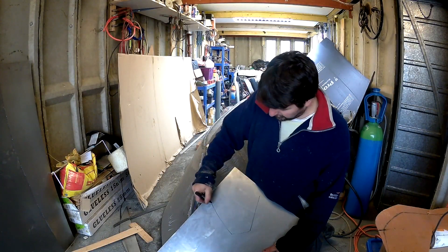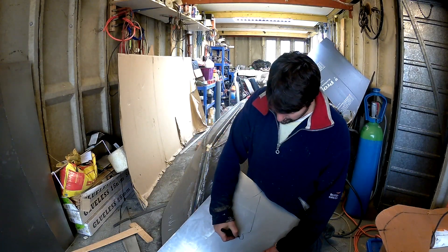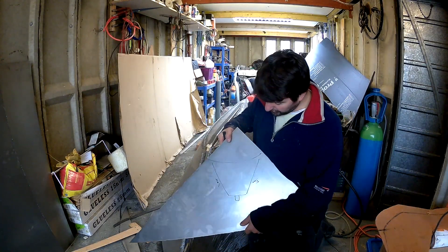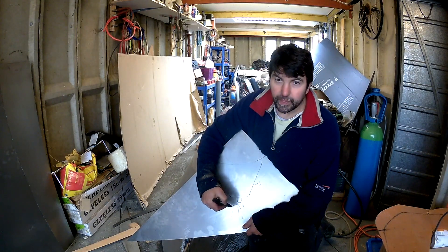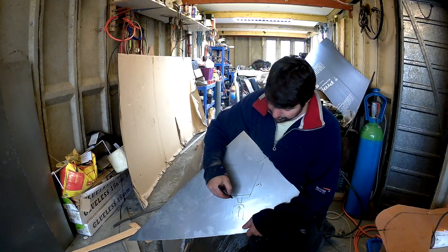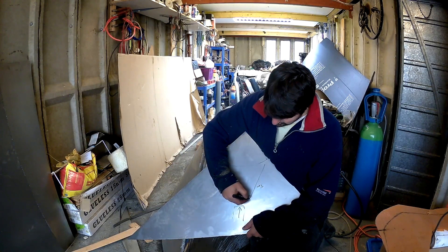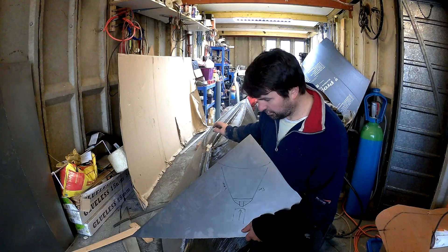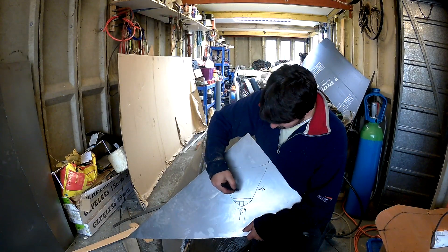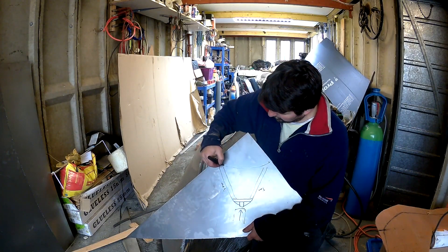My keel is going to look something like this with the boat up here. I've stuck this piece of skeg material on a fat piece of 3mm steel — so this is all 3mm around here. I'll put the blocks here and the boat will sit on here, but obviously this isn't strong enough on its own. Internally I'm going to put some cross braces at logical points like the bulkheads to spread the weight through the 3mm material. I'm also going to put pieces on the side to form a nice triangular reinforced section, which will make the bottom skeg really strong. Then at key points I'm going to have a couple of bits of box section that go up to the bottom of the boat.